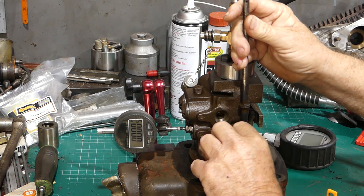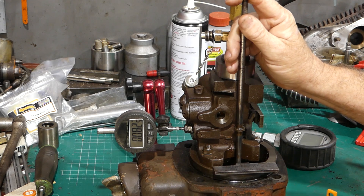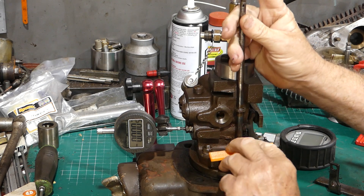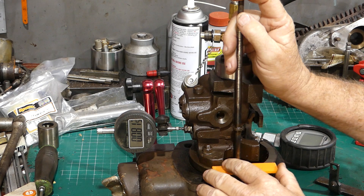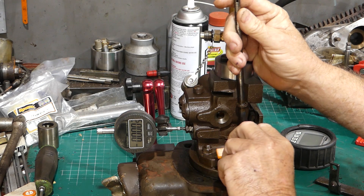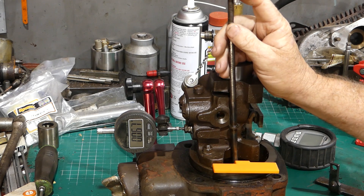Putting the original tool back without resetting the gauge, we read 82 thousandths — so we're within about half to one thousandth of an inch between the two tools. Making sure it's fully home, we read 82 thou again. In my mind that is certainly good enough to do the job — there's no significant load on this tool really.